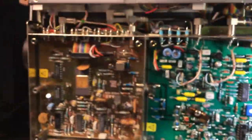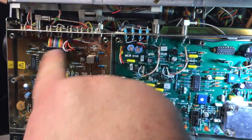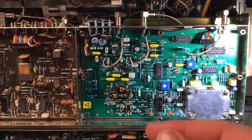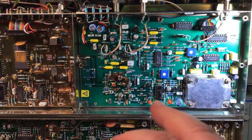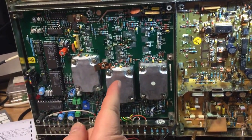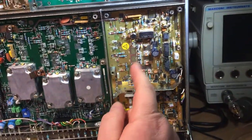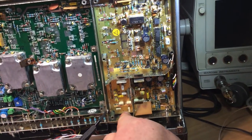To give a technical rundown of what I've ascertained so far: this board here deals with the frequency counter of transmit signals coming into the test set. This is a demod board dealing with all the modulation. The transmit power is measured on the other side with an RF attenuator and fed to a digital processor which reads the TX power. This board here is really the heart of the instrument — it deals with frequency generation.